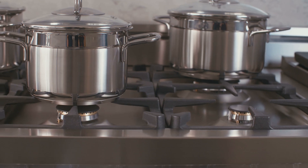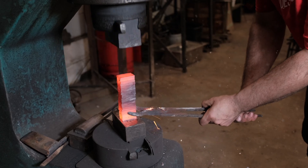The main thing with stainless steel is that you can get it to weld, but you've got to get the chromium oxide off the surface. Chromium oxide is very tenacious. This is why when you buy stainless steel pots and pans, they stay stainless for a long time. Unless you overheat them on the gas and they discolor — but that's just a different color of oxide. They stay shiny because the iron is not touched by oxygen or water; the chromium oxide on the surface is totally impenetrable and nothing can get through it. Therefore, if you want to forge it onto another piece of steel — whether stainless or carbon steel — you've got to get that chromium oxide off the surface.